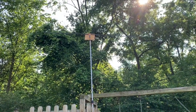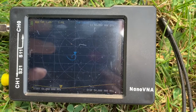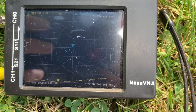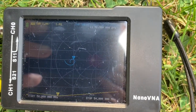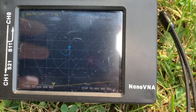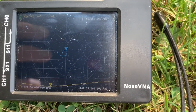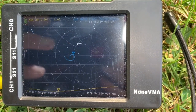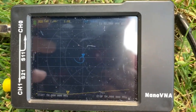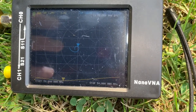So there I have it all the way up, and running that down into my Nano VNA you'll see it's bottomed out — I've got a 1.02 to 1 SWR at 51.36 MHz. The beauty of it is, because those legs are so thick, no matter where I am I'm resonant all throughout the entire six meter band. My resistance is 50.8 ohms right there. It does not move when I'm transmitting down at 50.3 or 51.3.